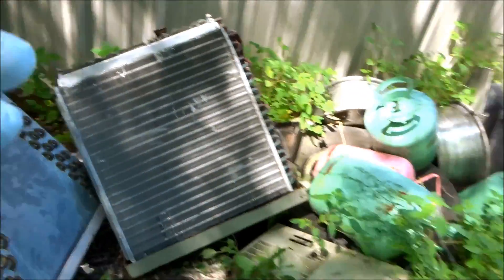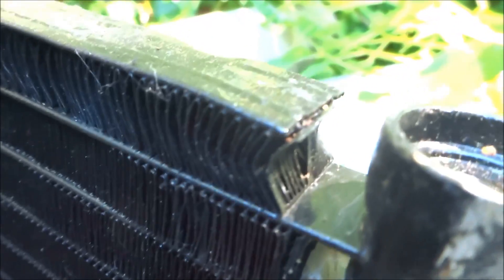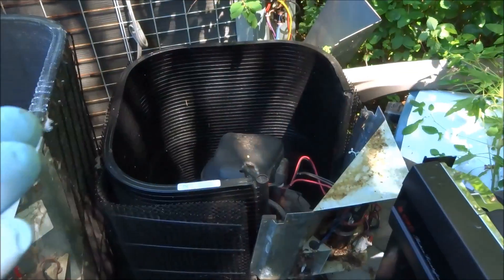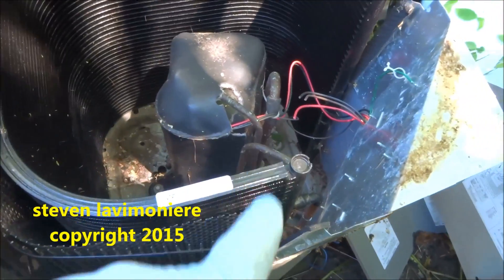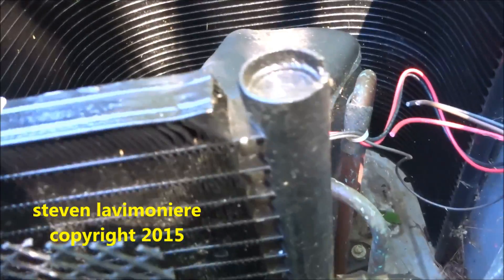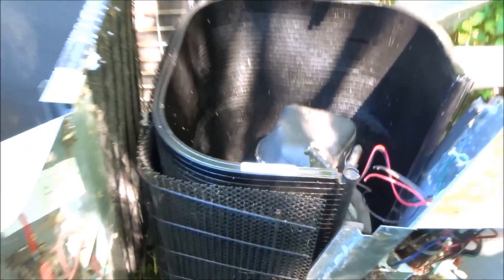The micro channel looks like this — it has flat tubes, and each one of those flat tubes has got like six or eight holes in it. The only thing they can say about it is that it doesn't hold a lot of refrigerant, but you can't pump them down either. By far, this is a bad design — a lot of leakers out there, a lot of problems with micro channel. You don't want that on your condenser in your backyard.